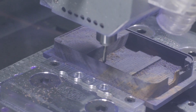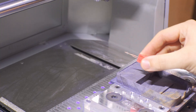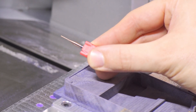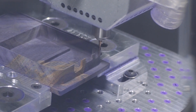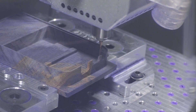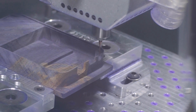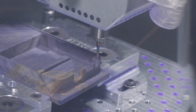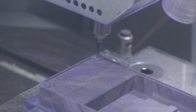A sufficiently large ball can also cut small chamfers, because geometry, so I'll do that as well. Possibly the scariest path involves cleaning up the port cutouts with a much smaller ball end mill, which has a diameter of 1/32nd of an inch, or roughly 0.8 millimeters. The diameter here isn't particularly an issue, but the cutting length of 1/4 of an inch — which is needed to prevent rubbing of the shoulder on deeper cuts — is much longer than I usually use, which makes it easier to snap. Thankfully this material is relatively soft, and this works out just fine. Finally, I switch to a slightly smaller flat end mill than I used previously, do a final contour on the inner lip, and bore out the screw holes.